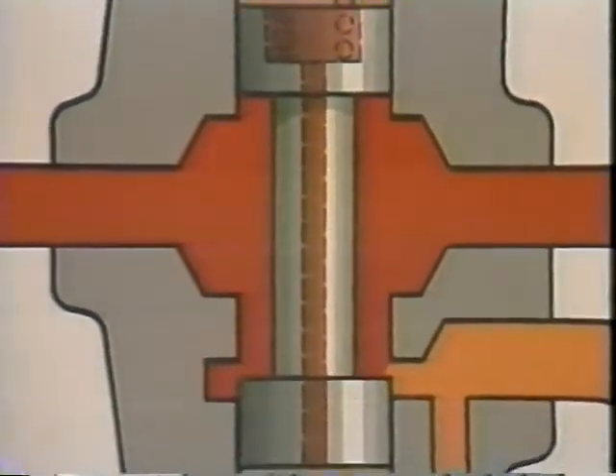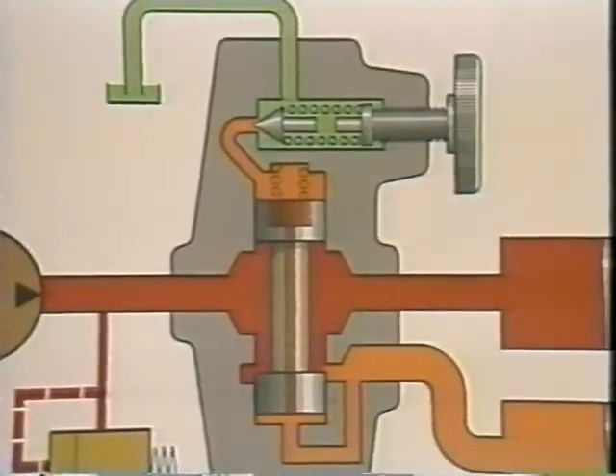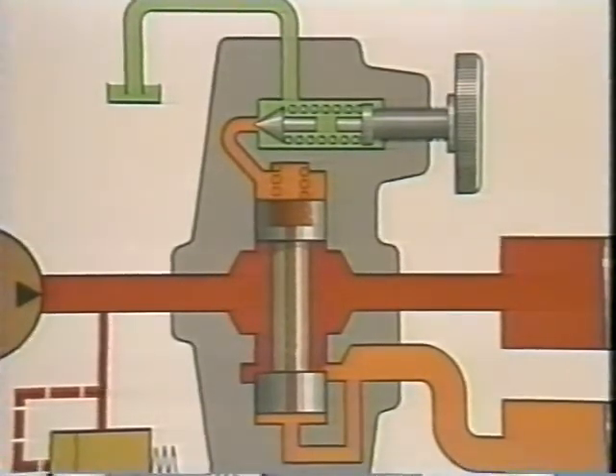A more realistic view of a pressure-reducing valve would look like this. A sliding spool fits into a body that has a straight-through port which never closes. High-pressure fluid can enter or leave through either side. A relatively light spring holds the spool down and open to permit oil to flow freely through the bottom or low-pressure port. Pressure from the low-pressure side is sensed under the spool to oppose the spring. Like the relief valve, our spool has a balance hole from top to bottom, so pressures above and below the spool are equal. A small poppet and adjustable spring in the top cover limit pressure above the valve spool. When the pressure under the spool exceeds the adjusted setting plus the light spring force on top, the spool moves up, tending to shut off the low-pressure port.